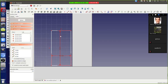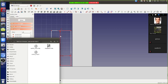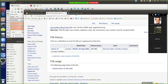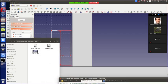That would be my consideration to choose 3.5. Okay. That's actually better, because then we're not wasting 2x12s. 2x12s are pretty expensive. And we have cutoffs of 2x4s. Justin, also in the chat, had a suggestion. What's that? He says if the grain is perpendicular to the cut, it could warp badly and also be split by screws.